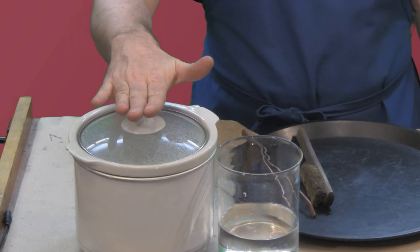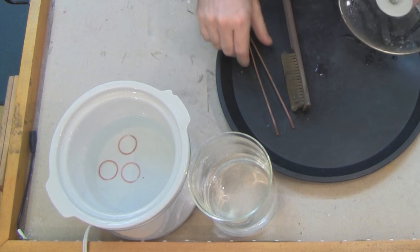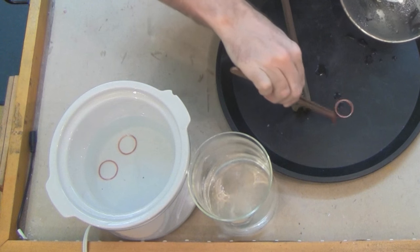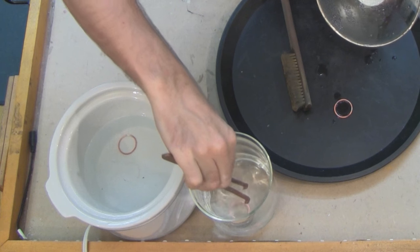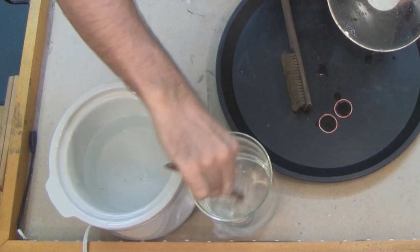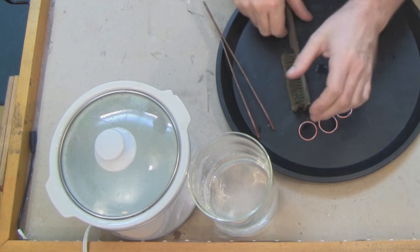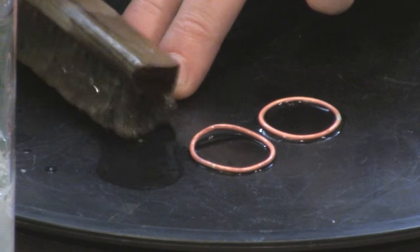The links have been in the pickle pot for a little while — let's open it up and take a look. There they are, pink as a piece of bologna. If you're soldering copper, you want it to turn this kind of bologna pink. It will depend on how large the piece is, how hot the pickle is, how strong the pickle is, but it shouldn't take more than just a few minutes. I'm putting them into some water to neutralize the acid. I've put a little bit of detergent in there so I can dip my brass brush into it to brass brush the surface.